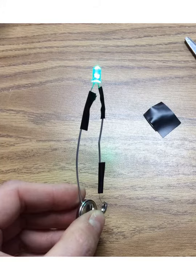It is a good idea to check that your LED will light up and that your circuit is complete. Take the battery with the flat side — the positive side — touching the long wire, and put the bumpy side — the negative side — touching the switch. Once you connect the circuit, your LED will light up. If your LED does not light up, that means there's a disconnect with your wires at one of the connection points or when you attach the switch. You need to troubleshoot if your LED does not turn on.